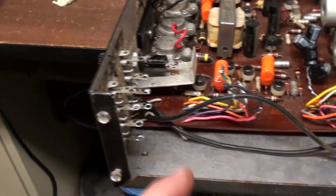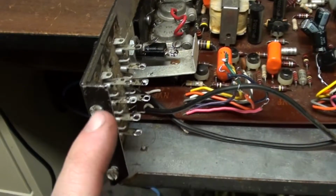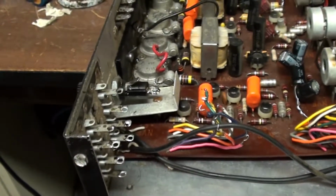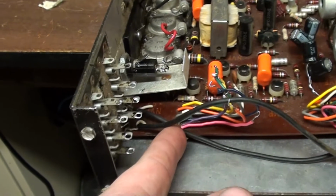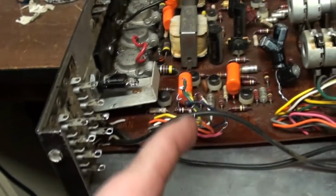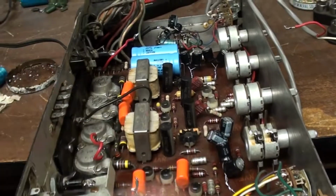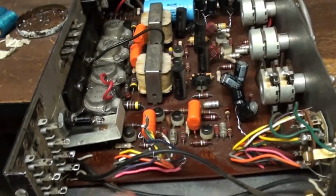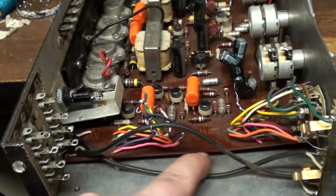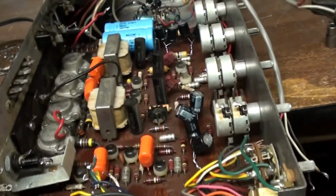Right now, this thing is kind of pinching this board between this surface that's solid and this one here that moves, so you want to have a little bit of play. When you have it too tight, this board will actually sit down onto the metal itself, which you don't want, because you would short this entire thing out, and this entire project that you're doing, like with me, for example, you would basically destroy all your work. So you have to make sure that this thing here is off the ground. This board is a little warped, but there shouldn't be anything that's touching it whatsoever.